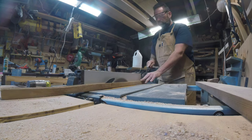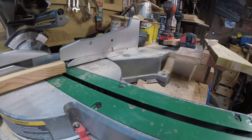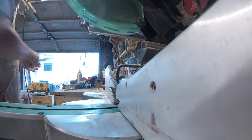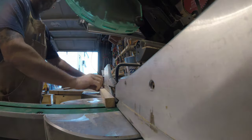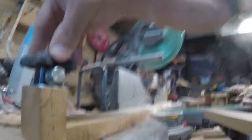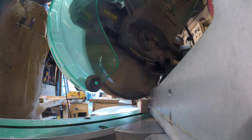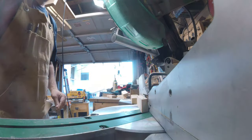A lot of this wood has been built up to a certain extent already. We're going to cut it on the table saw to the final width and then run it through the planer to get the final thickness. These are going to be thin pieces of pine — it's going to match almost identical to the planter that my wife's grandfather used to make. I'll probably give it to my wife's family, but I'll bring it to the show as a prototype and keep a template to build them faster in the future. Same steps as the last one except this one's going to be a 10 degree angle — it's going to be a more narrow, taller planter. We're going to use brad nails, glue, and some trim head screws for this build.